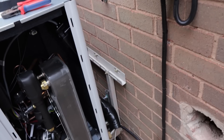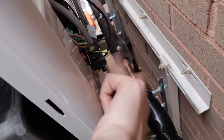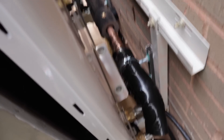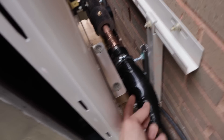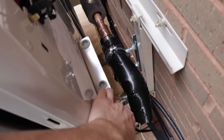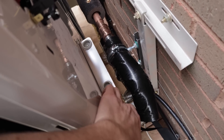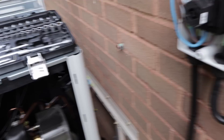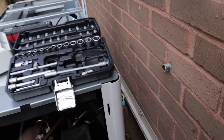I'm happy with the testing — just a few basic tests done so I don't damage the unit's delicate electronics. Now I can wire it up and get the live tests. I still need to do the board to get live tests available. Looking at the unit, there are nice cable gland entries — the bigger one is for my power cable, the smaller one for the bus cable. I'll slightly pierce the manufacturer grommets and push them through — Mitch from Bright Spark made a good point about keeping the manufacturer seals as they may be factored in as breathable air points, allowing the enclosure to breathe slightly without letting water in.